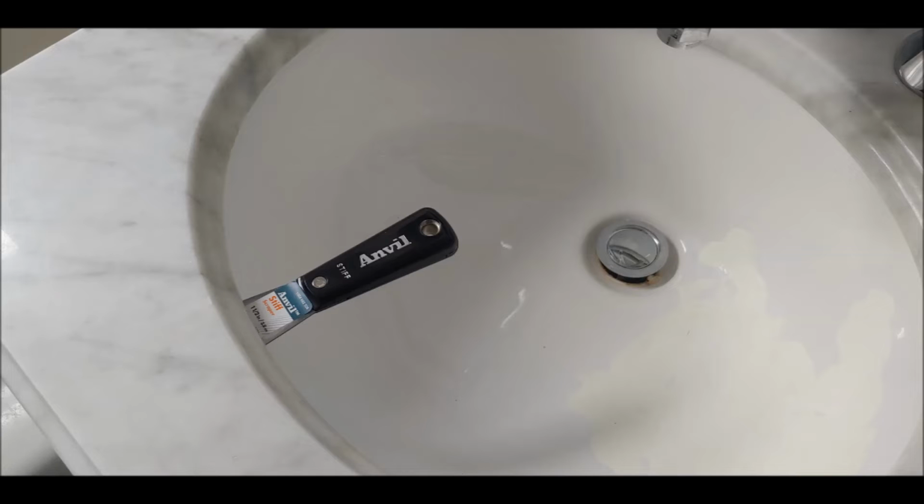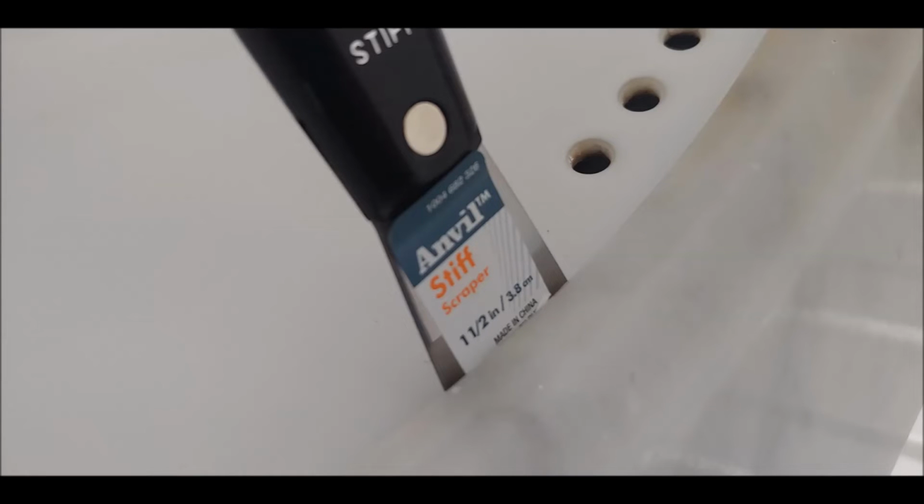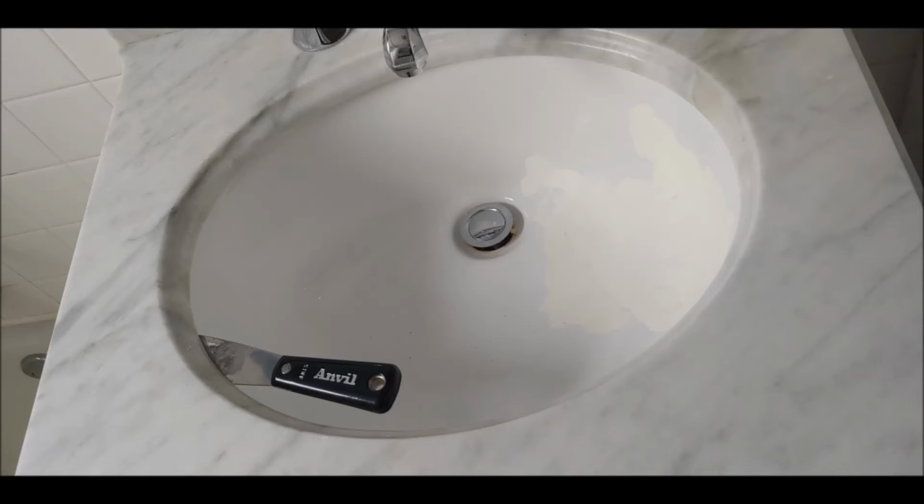So what I have here is a Home Depot Anvil stiff putty knife. Putty knives come in both flexible and stiff. You want to get the stiff one, and I will have this link in the description area of the video, this particular one I got. Now notice the starting point. I put this in the middle of the diameter of the undermount, and the reason for that is I want to start where the clips aren't.